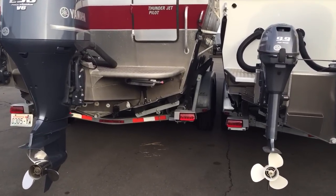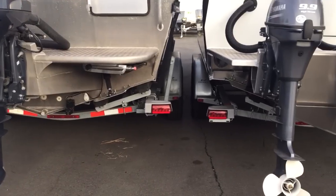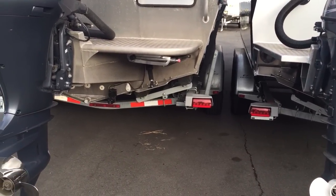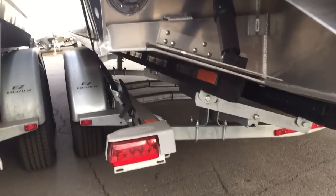If you are not shopping for heavy gauge welded aluminum and you look at a glass boat, pretty much every deep V glass boat that's been made for the last 30 years runs a reverse chine hull. Duckworth is one of the few heavy gauge brands that has integrated a reverse chine into their boat.